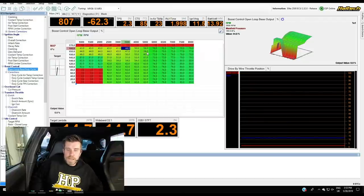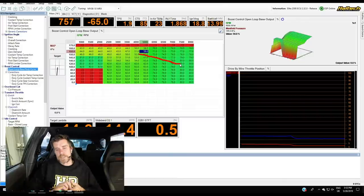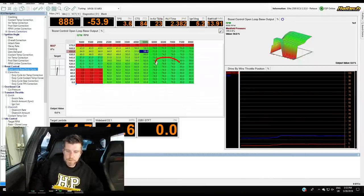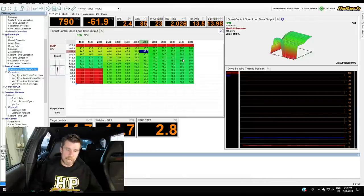The passive correction approach is less critical at higher RPM where our turbo can no longer maintain the target. By 7000 RPM we're down to about 110 kPa, so we're only briefly at 150 kPa before the boost falls away. We can still manipulate the table in the same way, but at higher RPM the duty cycle numbers are already up around 78 to 80% — basically all we can get out of that solenoid — so we're all in at that point and can't extract much more boost anyway.